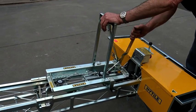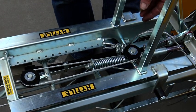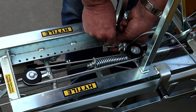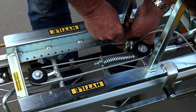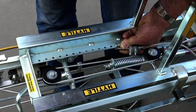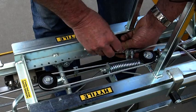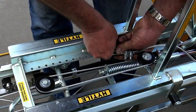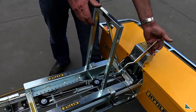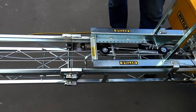To adjust the wire rope, pull back on the handle. This releases tension on the wire rope and allows the D-link to be moved up a hole or perhaps two. The wire rope is now correctly tensioned.